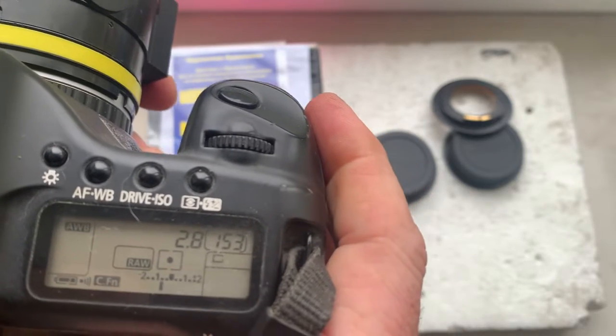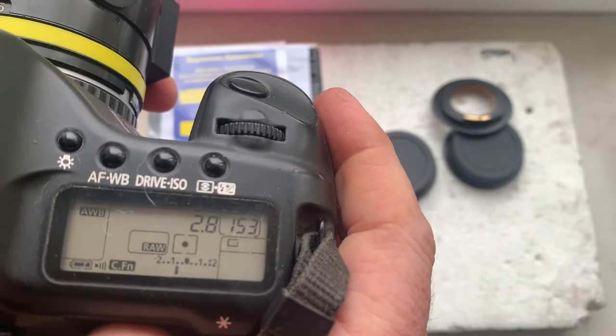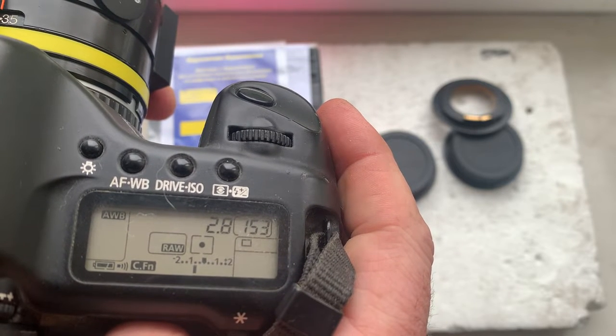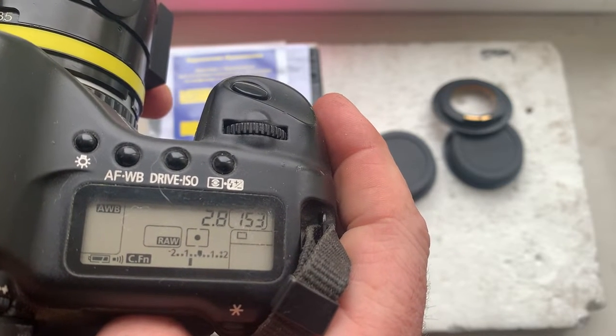The chip on this adapter is pre-programmed. Focal length is 80mm, aperture 2.8. Delay time to enter programmer mode is 1 second. Focus trap mode is off.